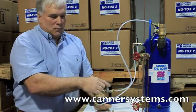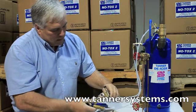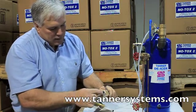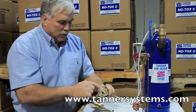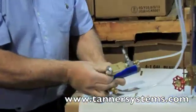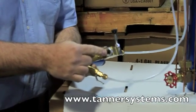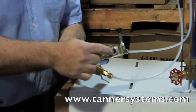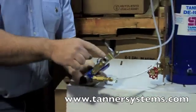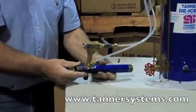The needle valve is for setting the fluid flow, just like on our small dispensers, though this one has a few more turns on it and works very well. This is a gauge glass — with the tube coming in off the needle valve, you can see the end of the tube. You'll be able to adjust it by watching the droplets on the end of the tube, and then the fluid will continue down and flow into the pipe and mix with your air.